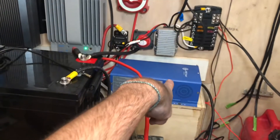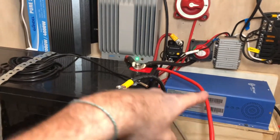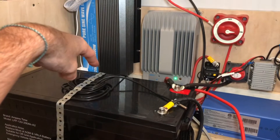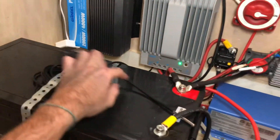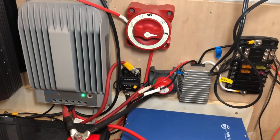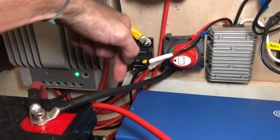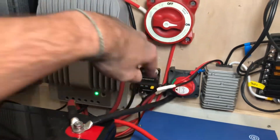Because it is a 24-volt system, this is a 24-volt charger — it can charge 12-volt and 24-volt, but right now it's in 24-volt configuration. It's connected to the positive of one battery and the negative of the other because these batteries are in series — negative connected to positive, and then the negative going into everything and the positive going into everything. Another thing coming off this charge controller is a little temperature gauge, which will alert me if things get too hot. I also have a main battery shutoff connected to the positive — that kills the power to everything.